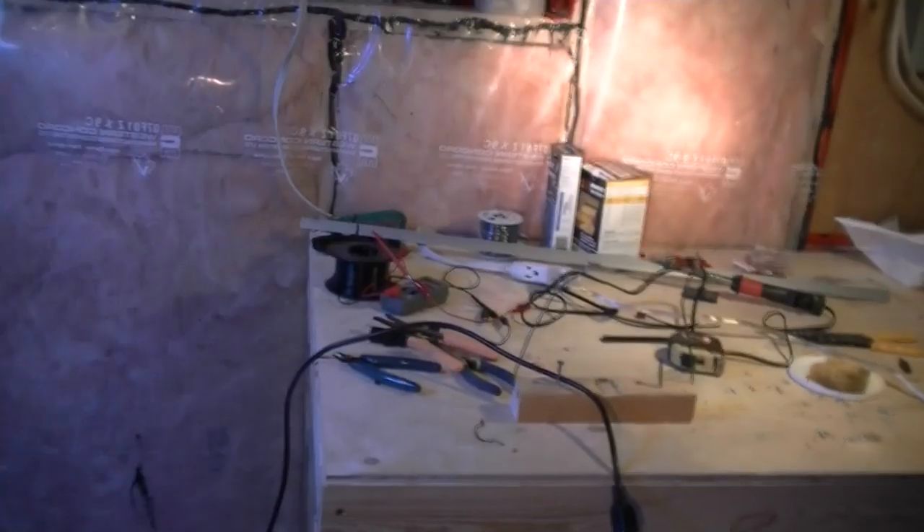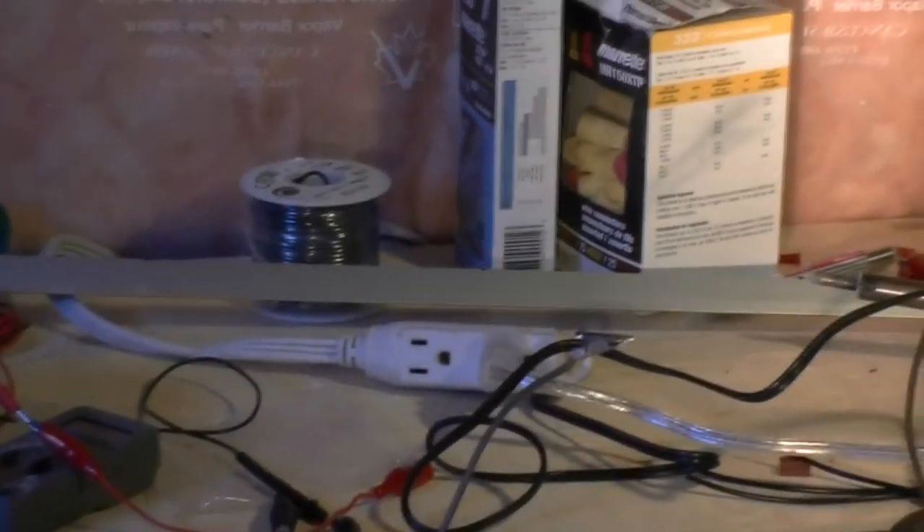I have wired up my moonlights. With the main lights I'm probably going to mount them before I wire them, but with these it doesn't matter — it's just one long string with a lot of wire in between. I've got my plus line going to a quick connect, which goes to my first LED plus, out the negative, into the plus of the next, negative to plus, so on and so forth, all the way back to the negative black wire to complete my string. That's my circuit — that's how it goes. That's going to mount to that long L-channel piece of aluminum, which will be my moon lights at the front of the tank spanning the length of the tank.